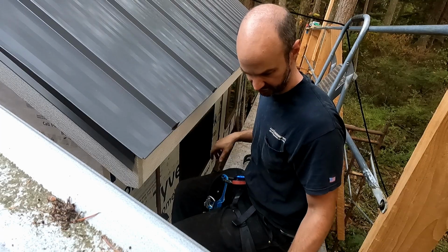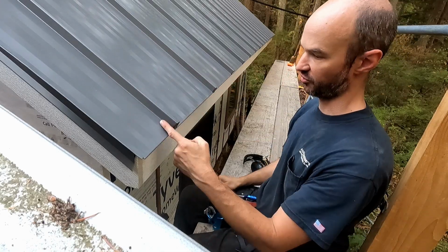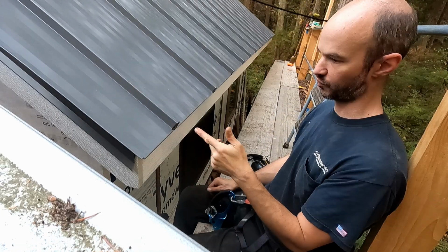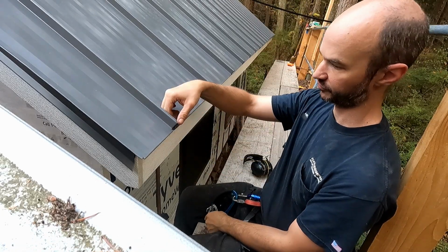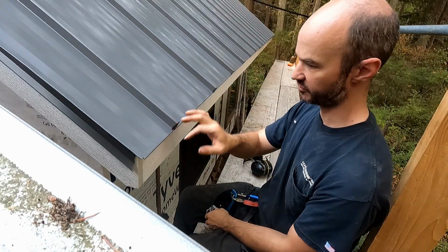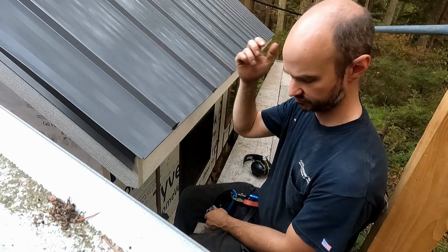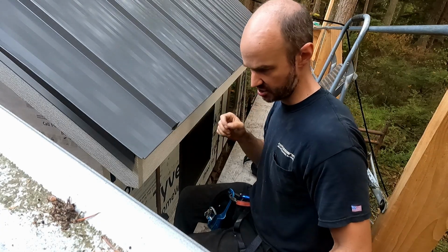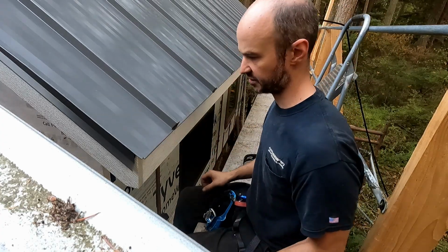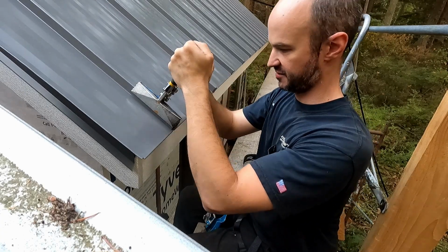All right, last thing before the panels are done are these closeout flaps. When I notched and prepped the panels, I left this face of the female side of the standing seam rib wide. I left a tab on it, folded it over and rough cut it, left a bunch extra on it. This is not really necessary for weatherproofing, but bees and bugs can climb up these ribs and make their homes there, and that's kind of a hassle. So these flaps just flap closed over the top, and I take a seamer here